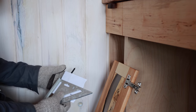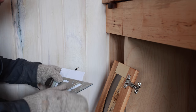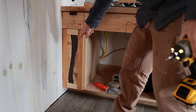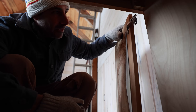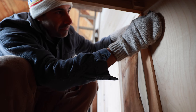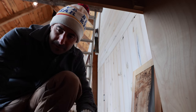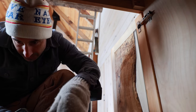I've got a template and found it's about an inch and seven-sixteenths in from the edge of the cabinet. I'll get the depth, place these, mark the height, pre-drill, and fasten. The screws allow adjustment in all four directions, so I'll play with that later. Just drilling a little pilot hole. My fingers are so cold — it has not warmed up that fast. We got the first one; it's enough to hold it in place.